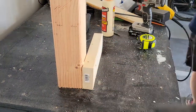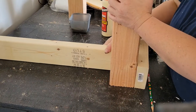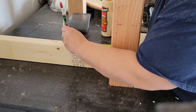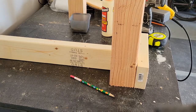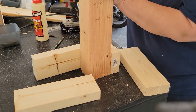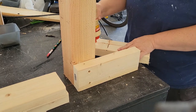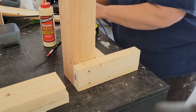Now I'm going to make the simplest base you can think of — just a bunch of two-by-fours. You can make them as long or deep as you like. I kept them on the shorter side so you're not kicking the base while sitting at the table. I start by taking four ten-inch two-by-fours and basically follow them around in a circle: put one two-by-four down, then go on the inside of the next. You'll see what I mean when I start drilling them in — it creates a pretty stable base.